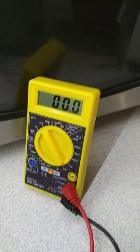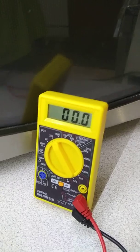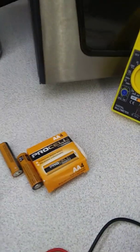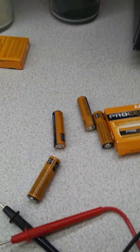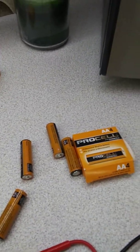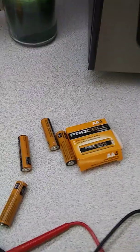And my headphones are electronic. Ain't like the old school where you can run them totally dead, because they have high-tech little circuitry in them, and they got a little computer chip inside that if it gets below a certain voltage, once you turn those batteries on, I've tried every one of my headphones. They'll last about 30 seconds. They shut down. They drop below 1.5 volts. Apparently 1.5 volts is a cutoff. Usually 1.4 volts for alkaline AA batteries are classified as dead. I said fully charged 1.6,